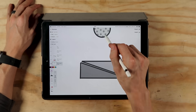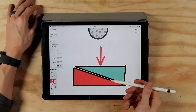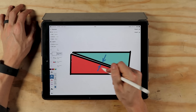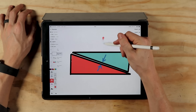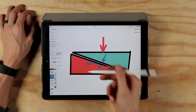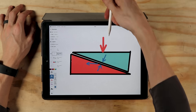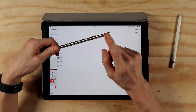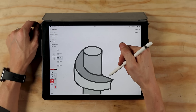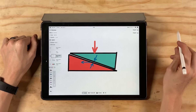This is how it converts linear motion into rotational motion. The reason my arrangement works is that this angle is very shallow. I can push on the top of this green wedge with any amount of force and it will not be able to push the wedge out. As this angle gets shallow, the contact forces between the two surfaces increases, which increases the friction. When I push down on the top of this wedge, a portion of the force is going sideways trying to eject the wedge from underneath. The force to eject the wedge is less than the frictional force, and it does not matter how much force I put on top — it will not eject. A neat parallel: this is why screws don't unscrew. A screw is just a wedge wrapped around a shaft — if the thread is shallow enough, it doesn't matter how hard you push or pull, it won't unthread.